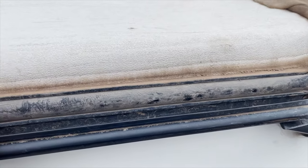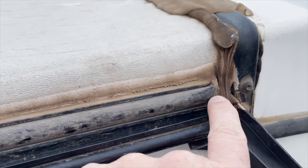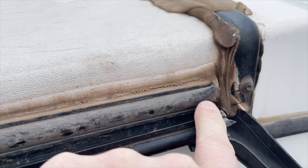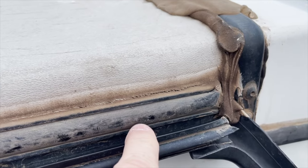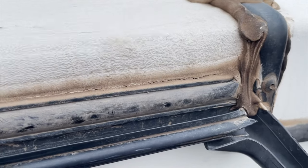This right here is the insert molding. I don't ever wrap the insert molding behind this the way the manufacturer does — when it's done that way, water and dirt get back behind it and can't escape, which causes buildup and damage.